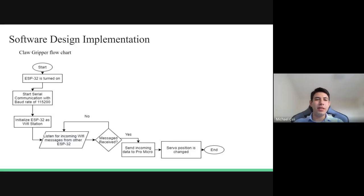For the software implementation, it initially starts off with the ESP32 turning on, serial communication with a baud rate of 115,200, and the initialization of the ESP32 as a Wi-Fi station, which listens for any incoming messages from other ESP32s. If it receives one, the information is sent from one ESP32 wirelessly to the other ESP32 and changes the position